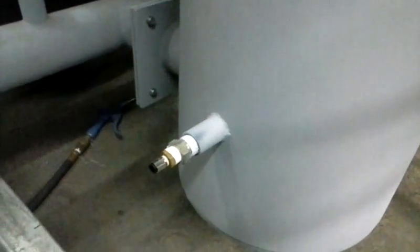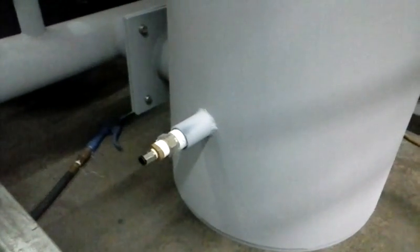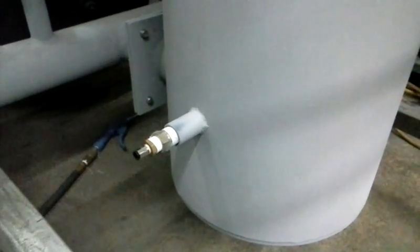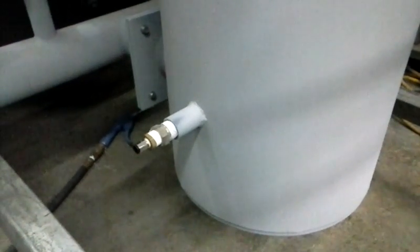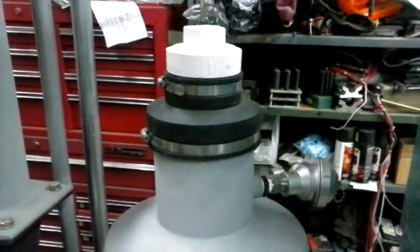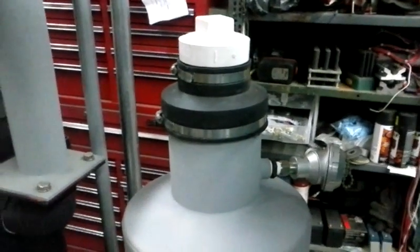I have fittings on the end of this coupler welded to the tank — that's actually going to be part of the sight glass assembly. There are fittings on the bottom of the tank it ties into, so you'll be able to see how much moisture is in there. You'll also have one of those duckbill floats hooked up to this, so when the PLC sees that the water level is full, it can turn the pump on to pump through the check valve — so no air is ever pulled into the system, only pumped out. For right now I just temporarily have this capped on top; that's the output of the expansion tank, capped so that when I do pressure and vacuum testing it doesn't leak air in.